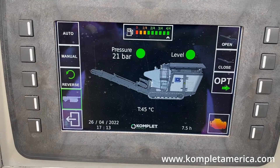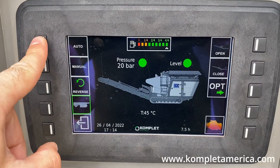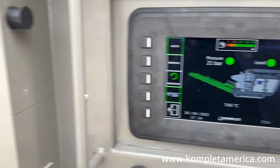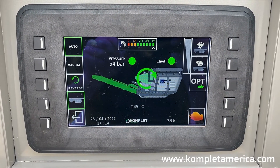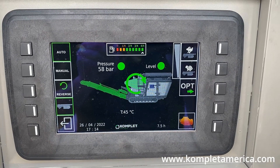To turn on the crusher functionality, press the auto button at the upper left side of the screen to automatically start all the crusher functions. This will have the engine go to working speed, the discharge conveyor start, the over belt magnet start, the crusher start, and the vibrating feeding hopper start.